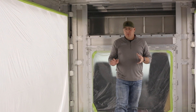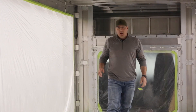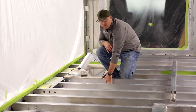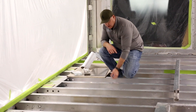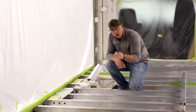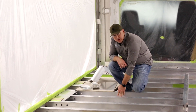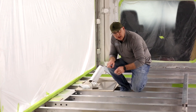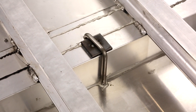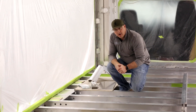I'm going to explain what we do and some of the unique things in our process. Our framing starts with a three by five — this is a three inch wide, five inch tall, half inch wall thickness, so the aluminum is a half inch wall all the way around. That three by five is sitting on a vibration dampener and the entire thing is U-bolted with steel U-bolts around the actual vehicle chassis itself. That gives us what I feel is the best foundation out there to work from.